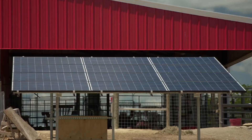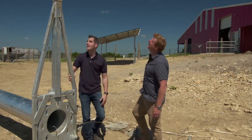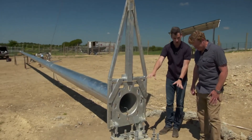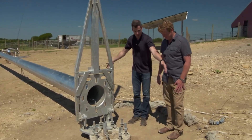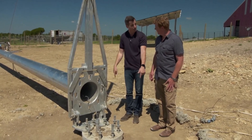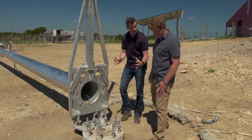We've got the solar system up and running — 3 kilowatts, 12 panels — that's already producing power. And this is our wind turbine pole. We're actually on a concrete pad, 9 foot in diameter, 3 foot deep, and then 3 additional columns that go 20 feet beneath us. So that anchors us here.